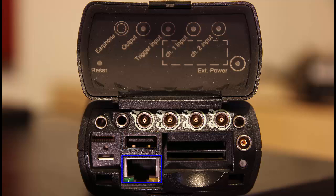The Ethernet port can be used to connect the meter to your computer as well. It can also be used to access the meter remotely via network connection such as a wireless or 3G or 4G modem. Through the connected network, we can control the meter as though we had it in our hand.